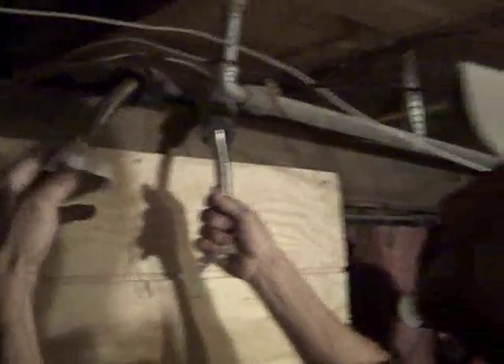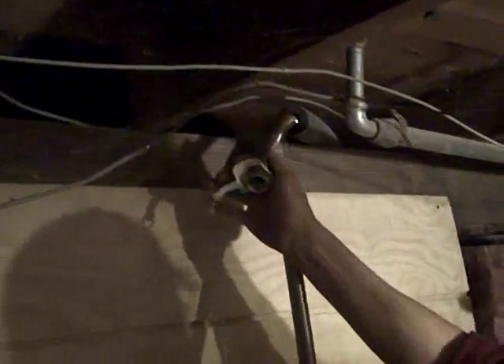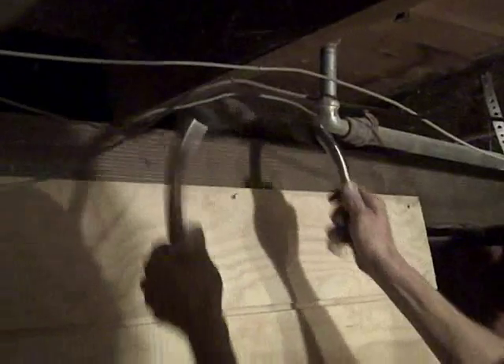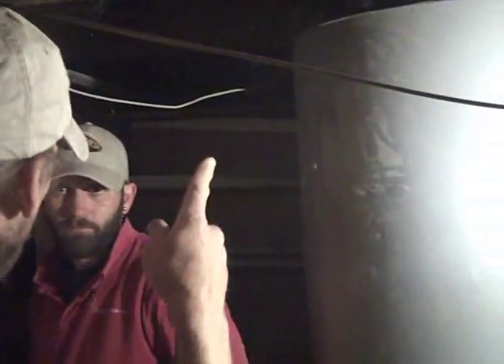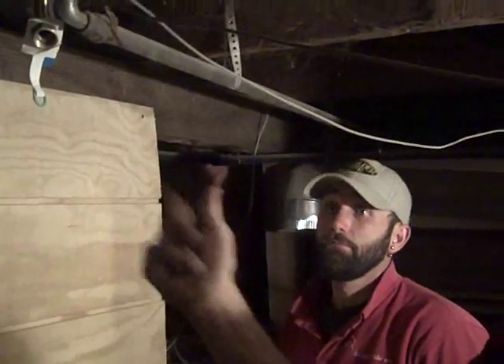So these are coming from the panels on the roof — you've got your hot coming out and your cold going back in. They're going to connect to the top of our pump house. There's a pump house with a digital readout. It'll tell us the temperature of the panels, the temperature of the liquid between the panels and the tank, and there'll also be a thermostat on the tank that'll tell us the temperature of the tank.